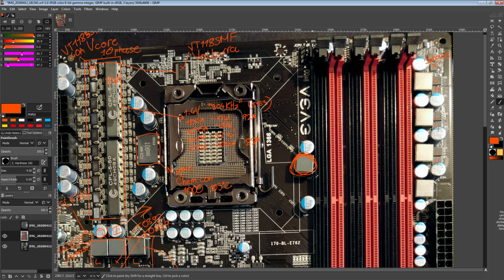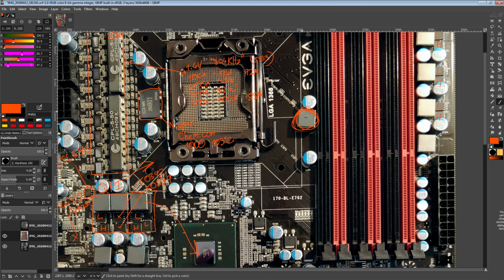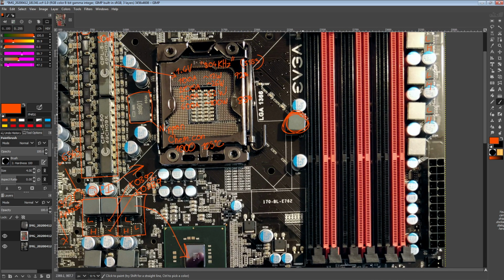I find it very strange because it's just like, why? You don't normally have inductors on memory power planes. That's just not a thing. So I really wonder what it's there to do. The only thing I can think of is that it's supposed to suppress current spikes from either the memory controller or the memory from reaching one or the other. Otherwise, why don't you just have a regular power plane like everybody else? Why is there an inductor in it?